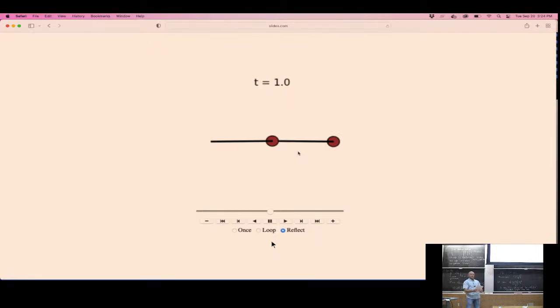No, you could have it similarly if I were to, you guys, I need to do some yoga or something, but if I were to go like this, and if I folded back in on myself, for instance, that could be on the inside. You could still call it the edge of a configuration space workspace. Your workspace in this case is more like a ring. That's right. Yeah, okay, so is there ever an example? I think with more complicated mechanisms, if you had a four-bar linkage or something, you could probably get yourself in trouble even in the comfort of the middle of your workspace. But it's certainly common that you would be up at the end of the workspace.